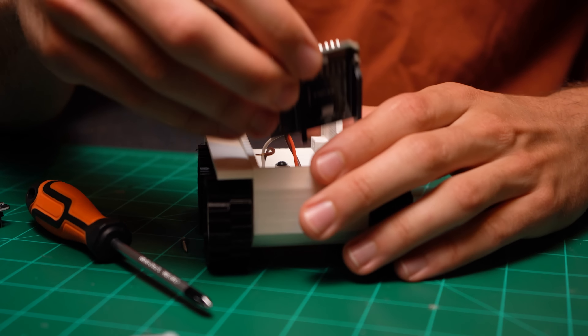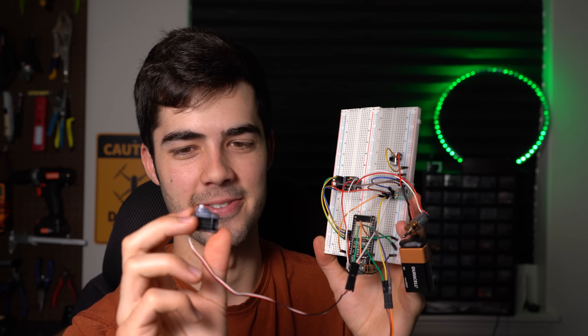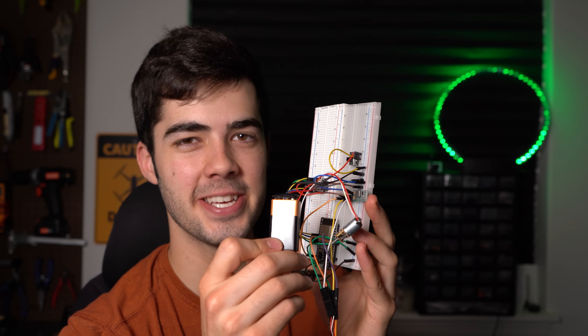Or you could write a little HTTP web page and use that as your controller. Moving on to our motors, we've got these tiny N20 motors — and don't be fooled by their size. These things are little monsters, like little Hercules. They connect into this little H-bridge, which if you're not familiar, pretty much just lets you swap the current forward or backward so that you can drive the motors forward or backward. Moving over to our servos, for the main arm boom I'm using this SG90 servo, which should provide plenty of power for the size we're going for. And then for our bucket tilt, we've got this tiny little WKPOO25. I've had mixed results with these, but I think for today this is going to work just fine.